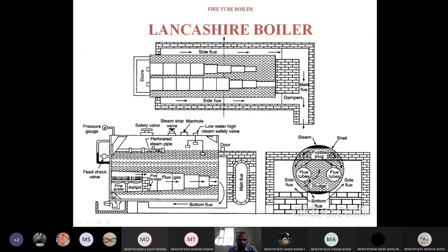The main use of this fire brick lining: it will not allow coal or ash to enter into the tubes. At the same time, it will deflect the flue gases in the upward direction. If you see the cross section of this tube, it is conical towards the end — the area is decreasing from one end to the other. If the area decreases, velocity increases, therefore it accelerates the flow of the flue gases.